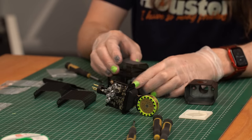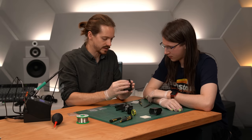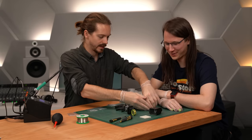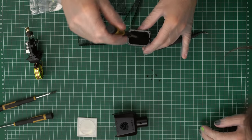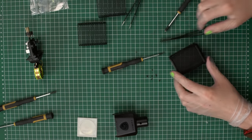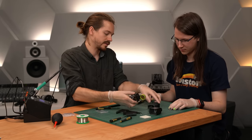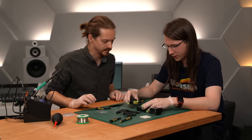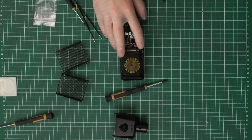Now we mount the inner mesh — ease it sideways onto the frame, keeping pressure regular so we don't put it out of shape. Now you can see the holes align. We have these very small screws — it gets smaller and smaller. The screws go through from the bottom and they meet nuts which need to sit on the top. The main reason to put the head basket on now is so we can mount it directly over the capsule, and then we can solder with peace of mind. So we join these two together — that should just slot straight on. Now things are securely inside and we're in a much safer position from getting solder into the capsule.